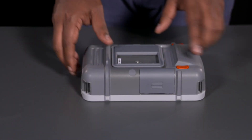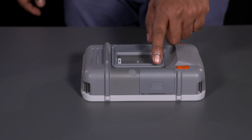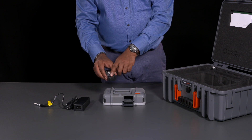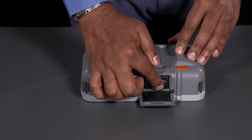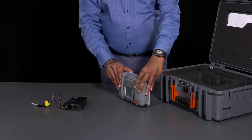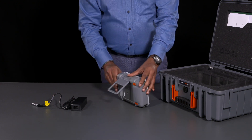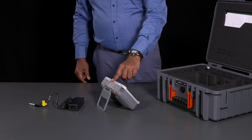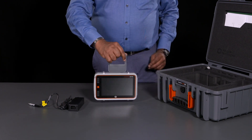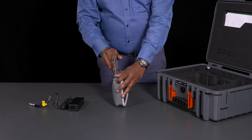On the bottom of the instrument is the battery door. The USM-100 has two batteries — one that is internal and the second one in this external compartment. Slide it to the back and it springs open. Align the battery, put it in, and close the door. This arrangement allows you to hot-swap the batteries while operating the device. On the back of the instrument, there is a kickstand that can be folded out to any convenient angle. The material around the stand is anti-slip, so the USM-100 can sit firmly on any surface while it's being used. The kickstand can even fold up 180 degrees and be used as a carry handle.